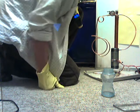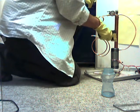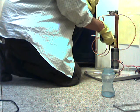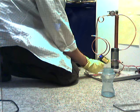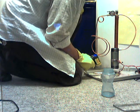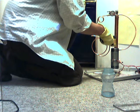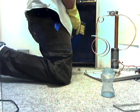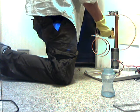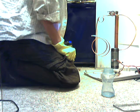Firing it up again. I may be getting some secondary reaction with this zinc — I'm up to about 8.6 amps. I'm at 120 degrees. The outside tank is showing 82 degrees. The water is starting to boil. I have a zinc pipe here, so I'm hoping there isn't some kind of secondary reaction going on. I'm at about 165 degrees, 13–14 amps now. It's boiling like crazy. I'm going to shut that down.